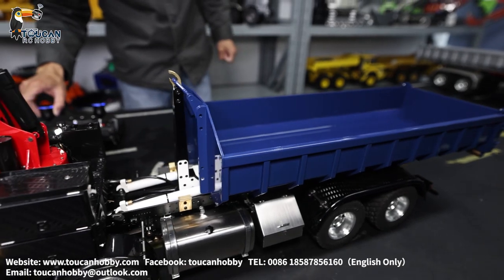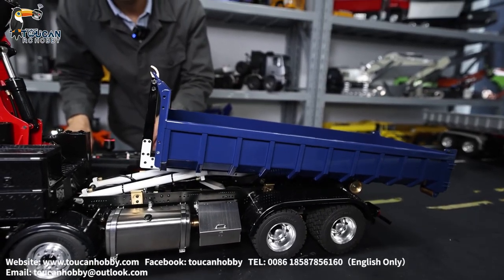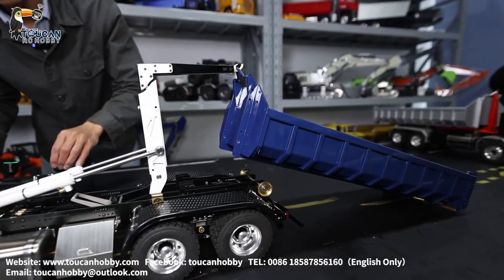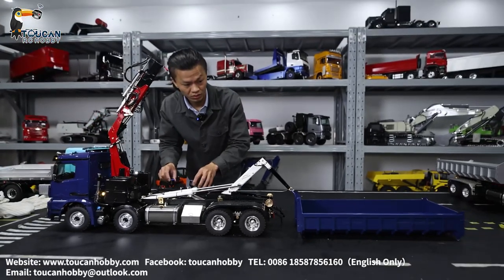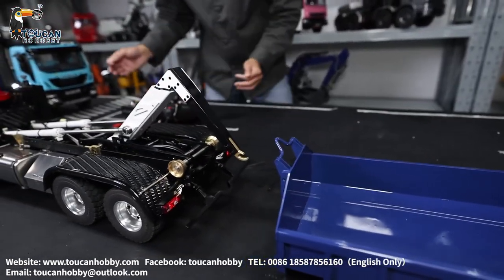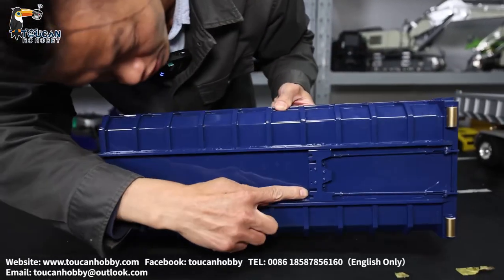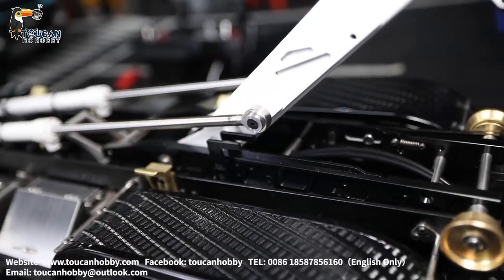So, unloading it backward. After sliding to the rear side, then you raise it up. I turned the crane. Let it down. Stop the pump. I'll show you the switch for the door — now it is locked, the door cannot open. Only when you're sliding the bucket forward, here inside the switch will be pushed by this bar, and then unlock so this door can be opened.